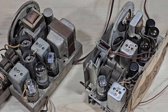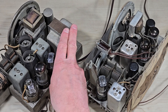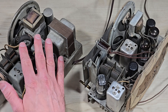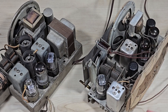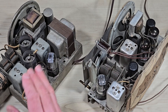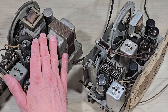The biggest difference is that the older set has a mains transformer. This transformer would have accepted 117 volts, converted it to 6 volts for the filaments, and then somewhere around 150 volts for the high voltage. This radio has no such transformer. Instead, the tube filaments add up to 117 volts and the high voltage is derived directly from the power line. There is considerable cost savings in that, because the transformer is a rather large and heavy piece. However, that made this set potentially more dangerous because it does not have the isolation that the older set does.